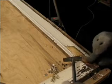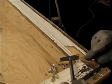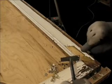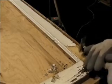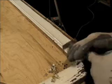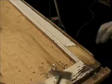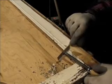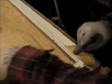Now I'm going to be careful not to scrape down into this area that I had already scraped and gave some more steam, because that steam will have softened up the wood, and if I scrape it, it'll scruff up the wood surface and pull out the grain. So I'm only going to scrape where there's been paint. Okay, it goes right down to bare wood real nice. I just scraped so it feathers up into this buildup of paint here. And now cleaning off the molding.